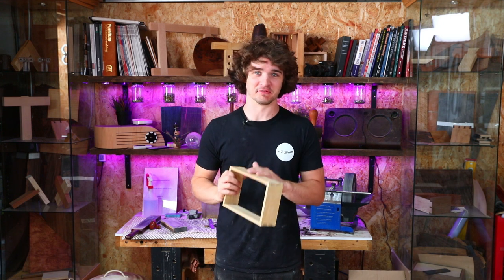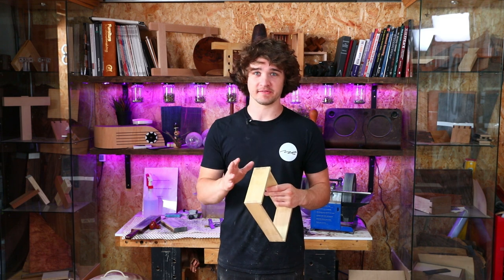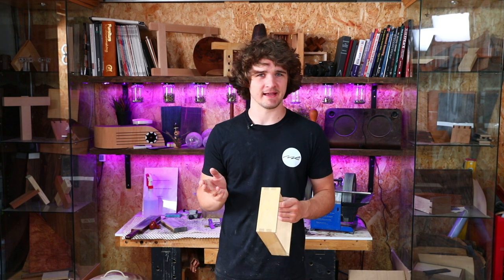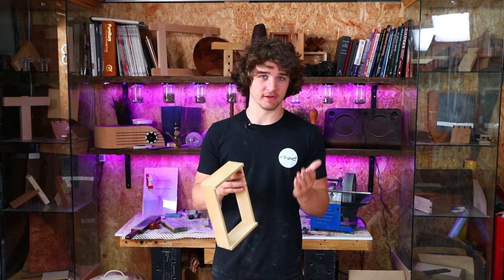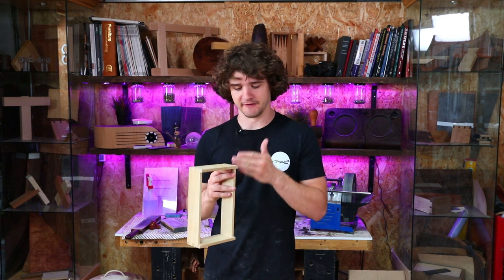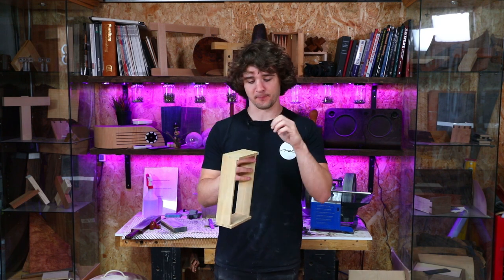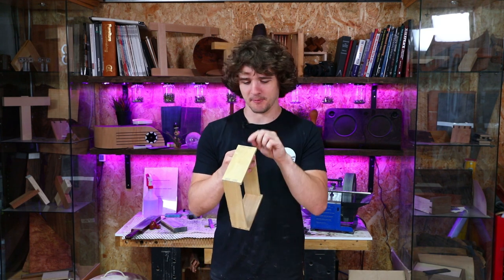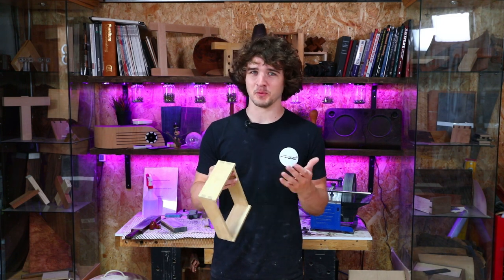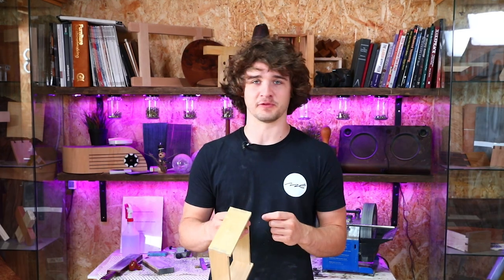That's a really good way of hiding gaps in joints naturally without resorting to glue-and-dust methods. It won't do wonders — it will close up gaps of half a millimetre and less. If you have gaps of more than half a millimetre, you'll want to resort to putting bits of veneer in those gaps, or slicing some shims off offcuts, cramming those in, adding a bit of glue, and flushing that off with the plane. The general public won't see it, but it will be something you notice every time you look at the box, which is often worse.